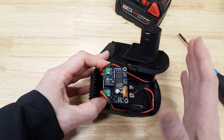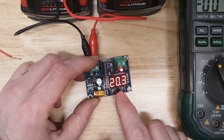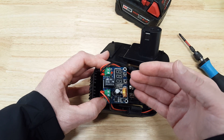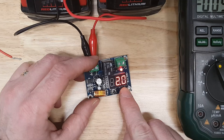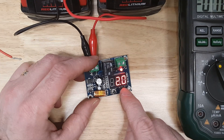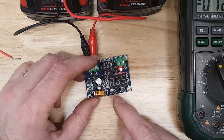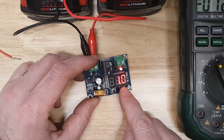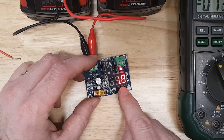To save the setting, you just wait and do nothing — it will stop blinking, go solid, and that is the saved setting. It doesn't need power to remember it. You can do a long press on the second button and it will show a number. The default as shipped was two, and that number represents the number of volts the battery has to increase by before the output turns back on. I left that at two, and it seemed to work pretty well.